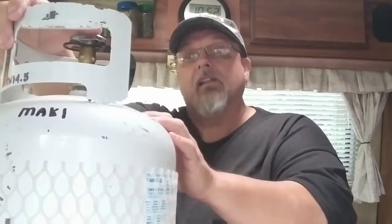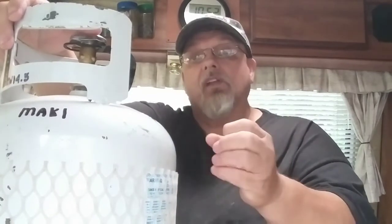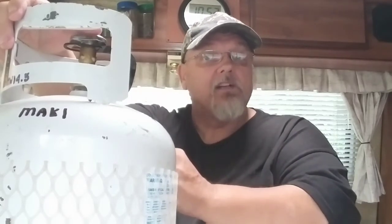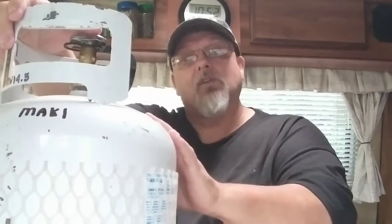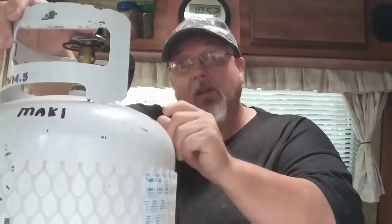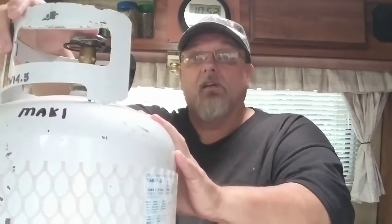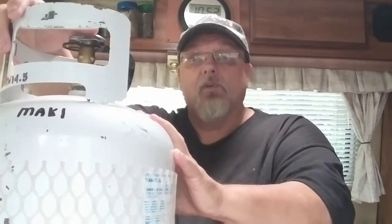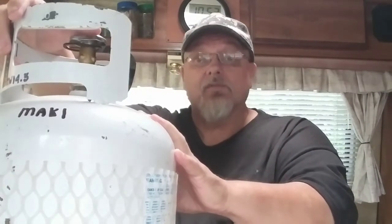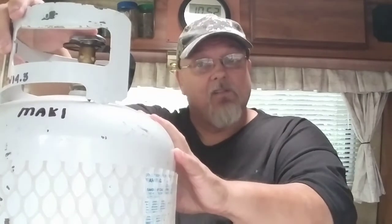By leaving the pressure in that line, next time you turn your barbecue on, you'll turn the tank on slowly again, but because there's pressure already in that line, because you've done it correctly, you won't hit that slam valve or activate the slam valve again. And if you don't do that, just still turn your propane on slow and you should be okay. But that will alleviate your problems with what you think is a wrecked appliance or even a bad regulator, which is not true. Your regulator is quite fine. It's just the slam valve.